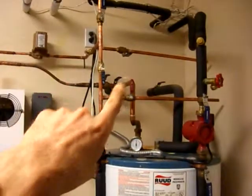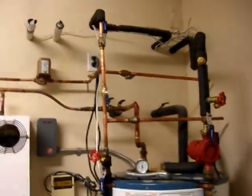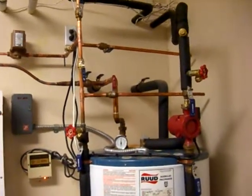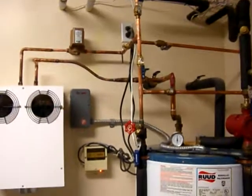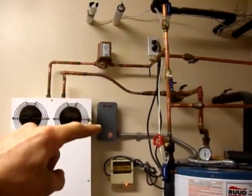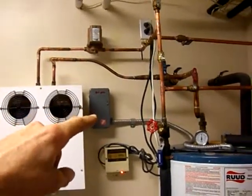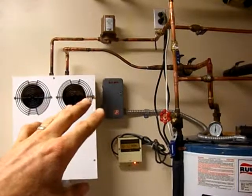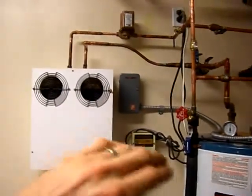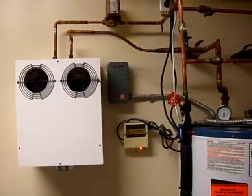I've got it set up right here. These pipes — that one there and that one there — are set up for an extra storage water heater later on. So I've got to wire this pump in here since I'm not using that. It's a 240-volt pump, so I'll wire it in here and put it on a temperature switch so if it gets below say 130 degrees the whole thing will automatically shut down and I'll still have water for my hot shower.